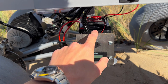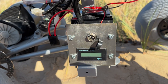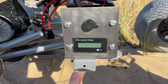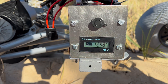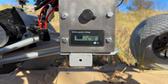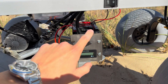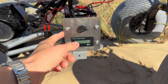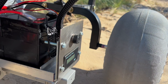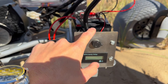I made a little steel panel here because I wasn't sure where to put the charger. Here's the charger — you take the cap off and that's how you charge the beach cart. The cap is on there just to protect it from sand. Down here is the battery capacity and voltage indicator. When I click it, we're at 73%, and clicking again shows the voltage — we're at 24.8 volts. It turns off after 10 seconds of inactivity. The steel plate is attached with a corner bracket — nice and sturdy, not wobbly at all.